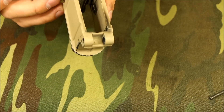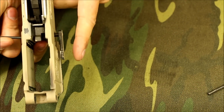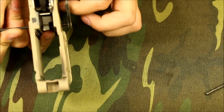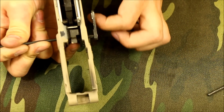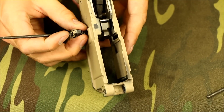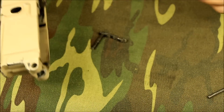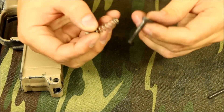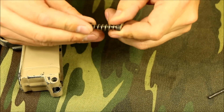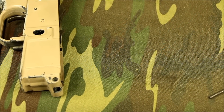Back on the lower, we're going to need to drift out a couple of pins and knock out this magazine release. The magazine release is actually pretty easy — we're just going to be pushing in on this and spinning out the other side. I'm just going to grab a pin here to push in that magazine release, just to get this other side showing so I can then rotate it off. Just to keep them together, I'm going to pop them in there and put them on a thread or two so I don't lose them.